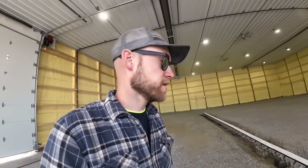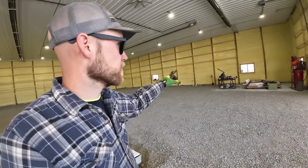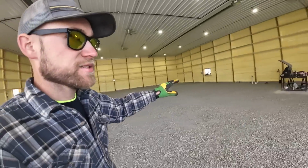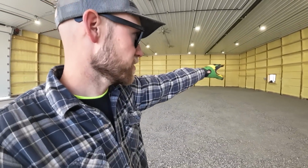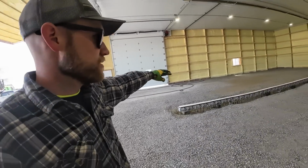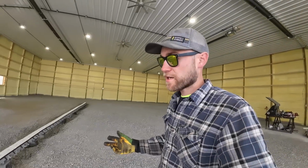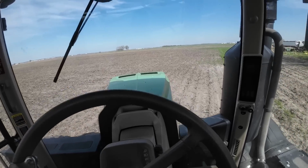We just got it out the wall, and then we gotta put an oil separator in, and we gotta hook it into a field tile after that. Got stuff in over there for a bathroom. Eventually we're gonna put an office with a bathroom over there, so that'll be nice. So it's flat from here over to the wall in case we want to work on stuff there or put pallet racks or whatever. And then it's sloped from here and here into the drain, so water will drain. So it's coming along. Could possibly get concrete tomorrow. Not sure yet.